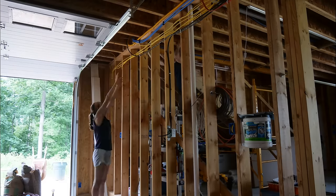We're doing a freezer in the garage too. We might also get onto some of the receptacle circuits, which are like the second easiest thing — just one home run from the panel to a circuit box and then basically daisy chaining receptacles from there. We have some friends coming to help today, which is going to be awesome, so we'll probably make a lot more progress than we're intending. None of us are electricians, so we'll do the best we can.